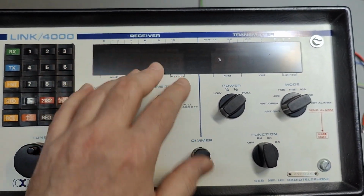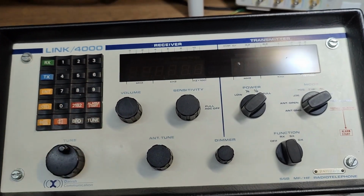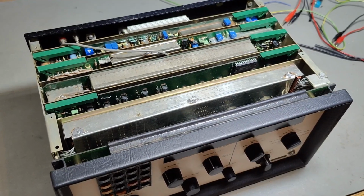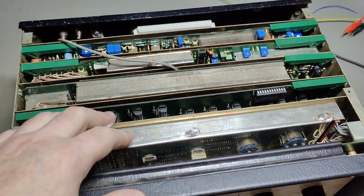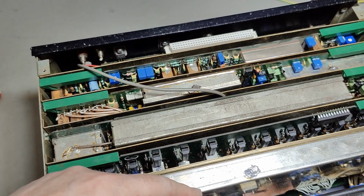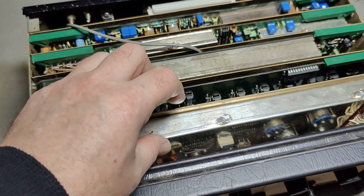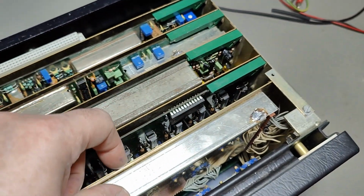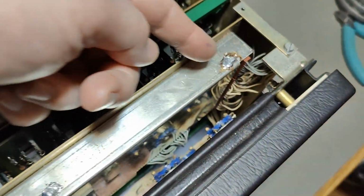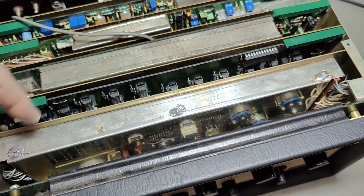It is from 1986, so this one is Z80 based. Yeah, Z80 based. How nice. First impression, absolutely beautiful. It's made with plug-in boards and a motherboard. Down in the other end, that will be, of course, the CPU section, perfectly shielded. And we got some cables that are going to some different things. It looks like all these cables go down to the front panel. And there's probably a motherboard connector as well.